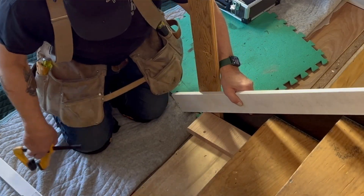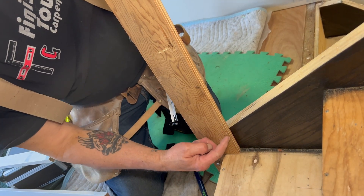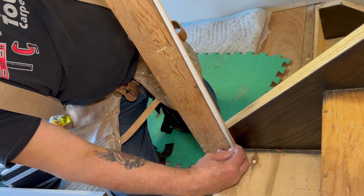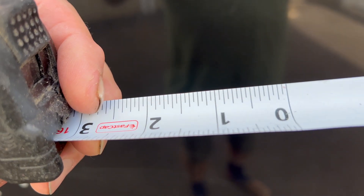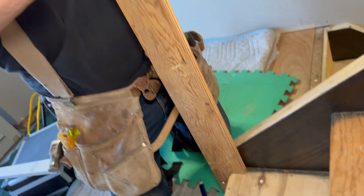So that's what I've adapted. Now that I have my true rake line established here on this story pole — cut like the newel post will be — I can use my burn-one tape measure and measure from that line up 36 inches, and that will be the top of my railing.